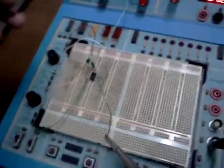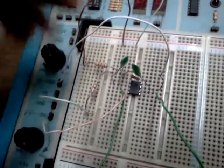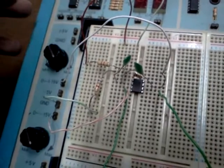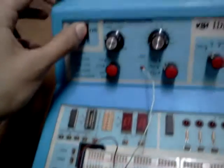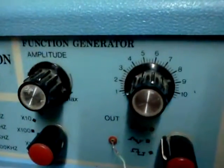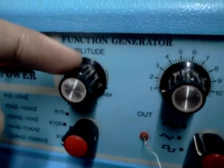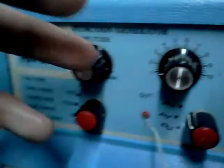This is the breadboard design — please come a bit closer. You can see we have connected the circuit; it's not very neat but that's how it's connected. We turn on the supply and this is where we vary the frequency to see if it works. The amplitude is fixed but we vary the frequency, and you can see that the filter is working.